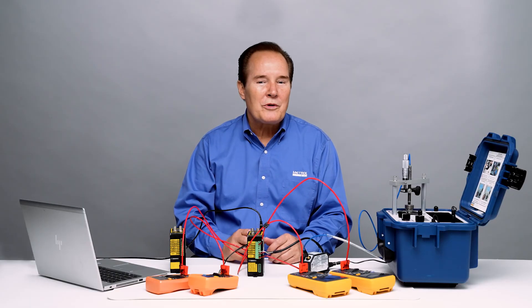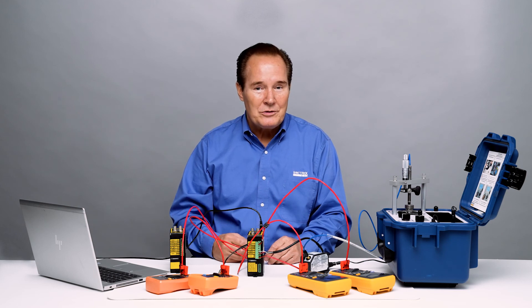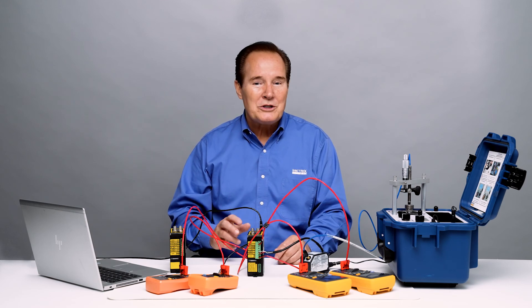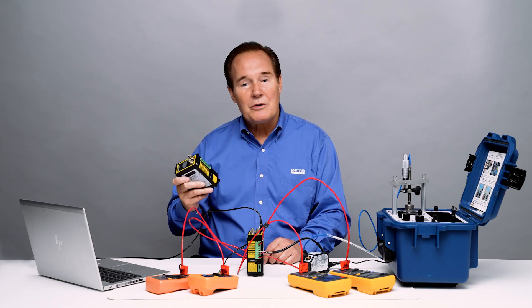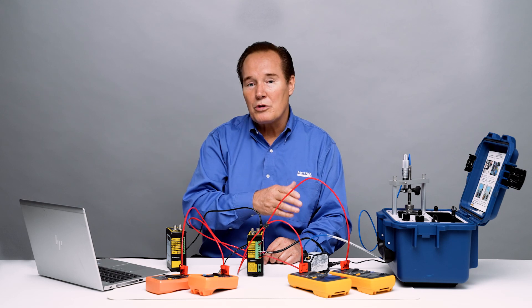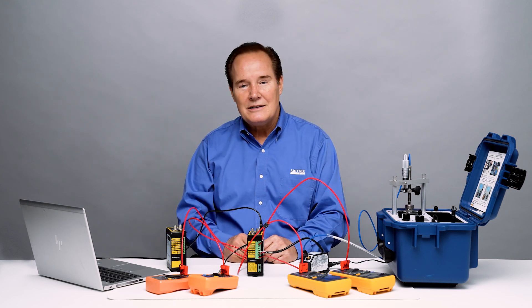In this experiment we showed that with an MX2033 proximity sensor we could come into channel one and get two outputs: position on channel one and vibration on channel two. We could also swap those — vibration on channel one and position on channel two, so either works. Both position and vibration were accurate and the relays did exactly what we expected. When used as a signal conditioner, you get the 4 to 20 mA outputs plus the amplified signal. The raw signal from a proximeter can go 300 meters, and with the signal conditioner or switch you can send it another 300 meters, providing a lot of flexibility. Thank you very much.